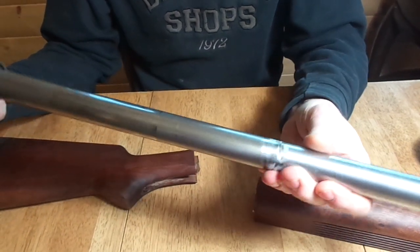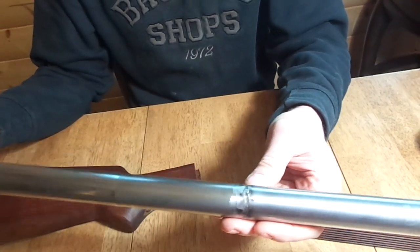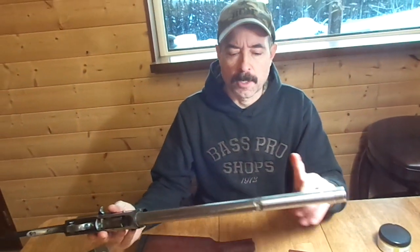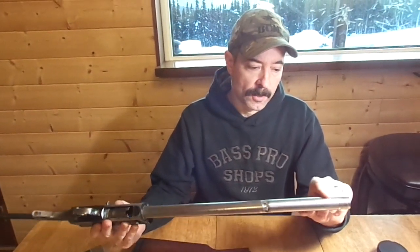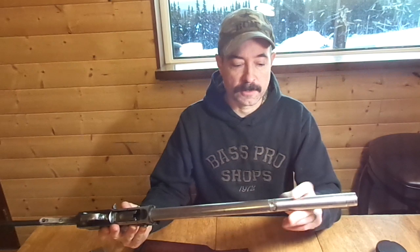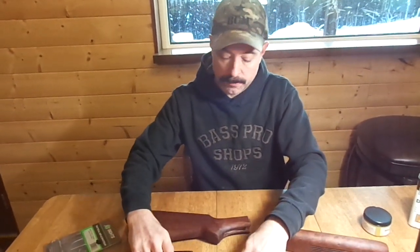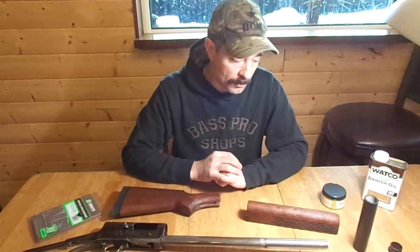I think he did a pretty good job — it's 100% functional. There was a hole burned right here, but it shouldn't have any effect on function. It's smooth inside and shells feed fine. I actually purchased an additional mag tube from Numrich Gun Parts, cut both mag tubes, and spliced two together — TIG welded. It appears to be a very strong welding job. It is a little cosmetically challenged due to my initial MIG welding attempt.